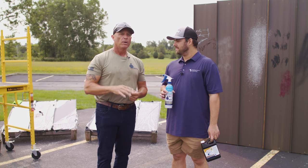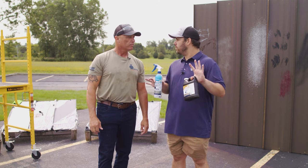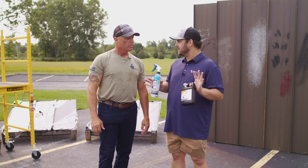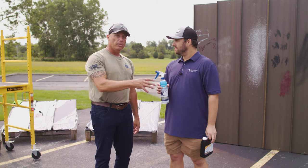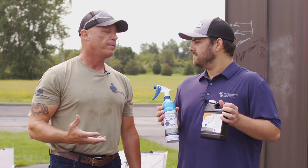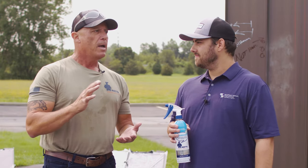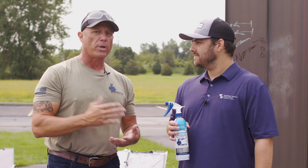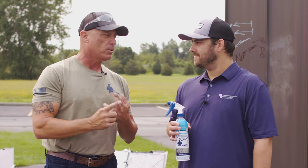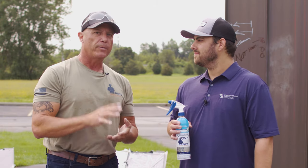We're not going to damage the landscape when washing a roof or the side of a building. A big question is: our contractors know that Sheffield Metals uses Sherwin-Williams paint on their system, so what does this do to the Sherwin-Williams warranty? Clean Sweep and Crossover have been tested and approved by Sherwin-Williams — about 2,500 hours of testing. They're on the global specification as the two recommended products alongside water. It won't damage the sheen or take off the paint.